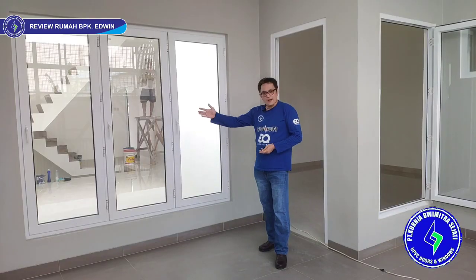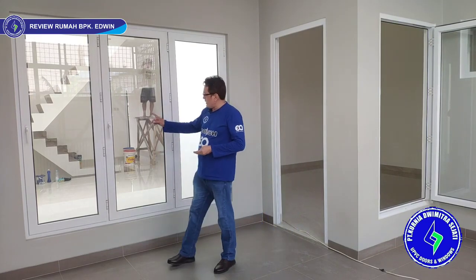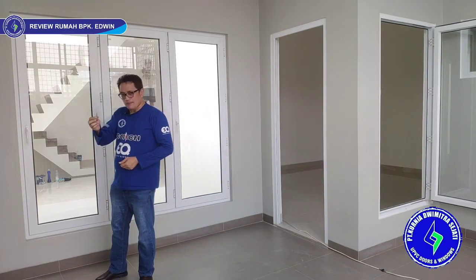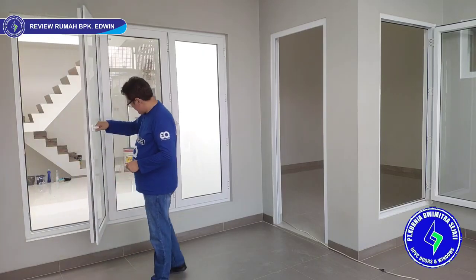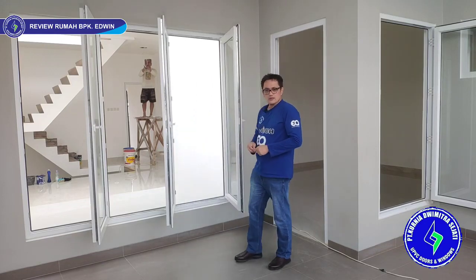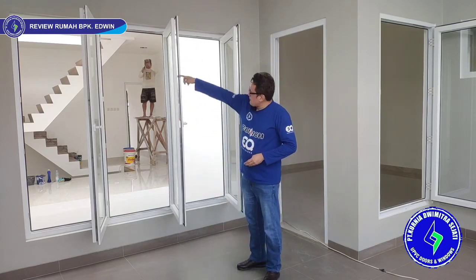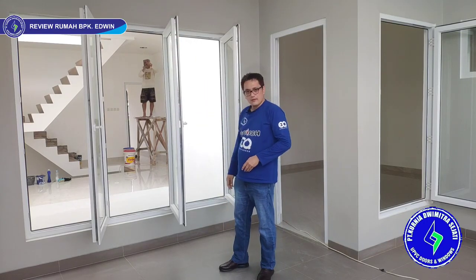Now we are at the back of the house, facing the void. The window handle is positioned on the outside. We also use a small key here for extra safety — one key works for three windows. To open: press, then rotate. This is a swing window with hinges, three leaves. We use hinges throughout, complemented by wing brakes top and bottom. The locking system uses multi-point locking with four locking points, making it more secure, safe, and soundproof.